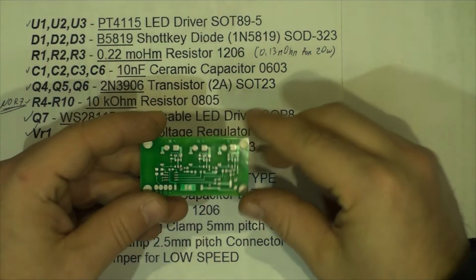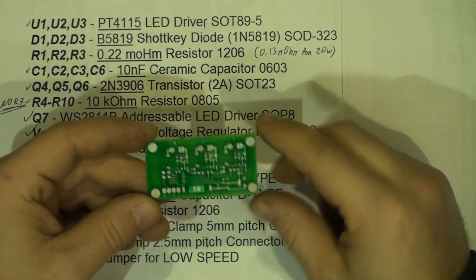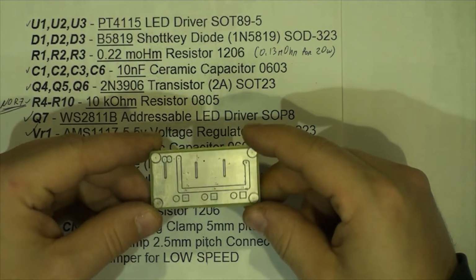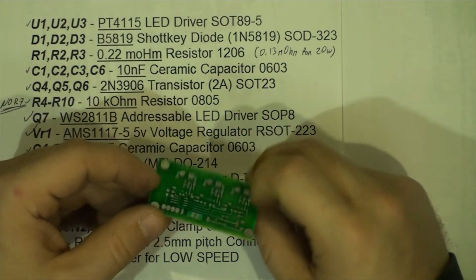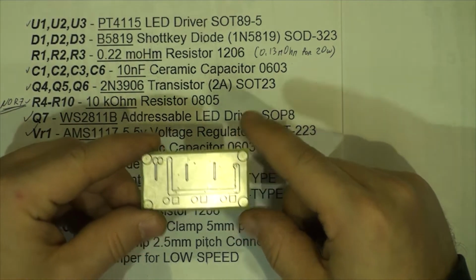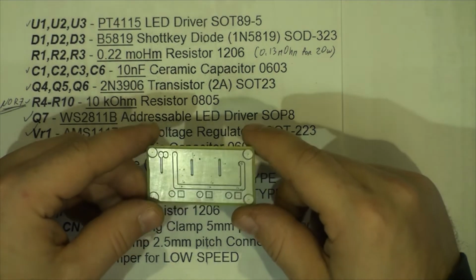The board is now ready, and this is just a prototype. It turned out a bit shitty. I've scratched it a bit just here. The other side I didn't laminate with green because that doesn't have any components, so I don't need a solder resist on that. The green is obviously a protection, but also it is for solder resist, so there's no components here. It has, however, been tinned, so it shouldn't rust.